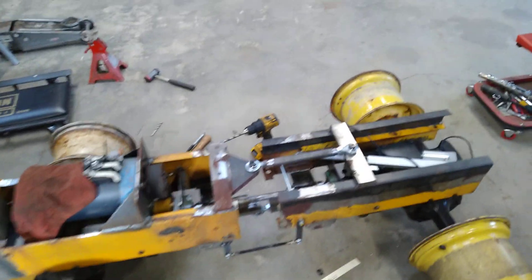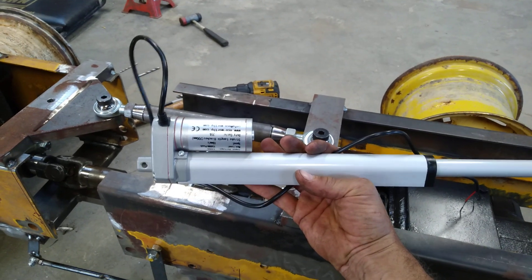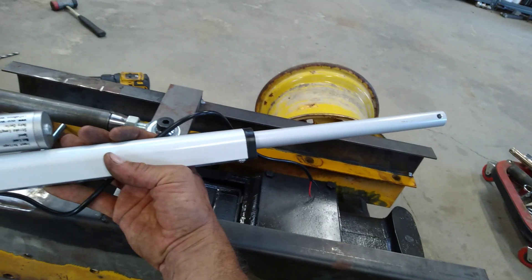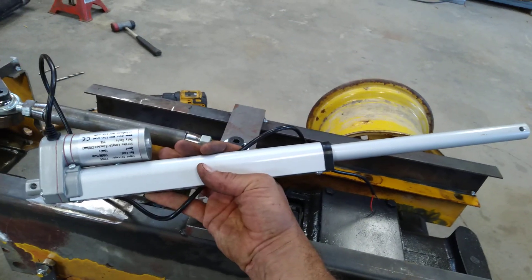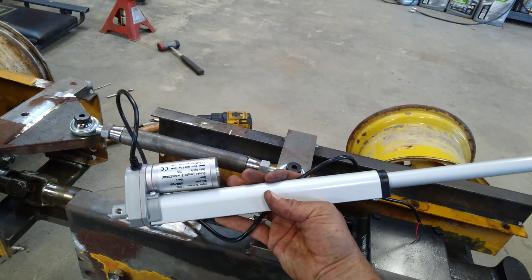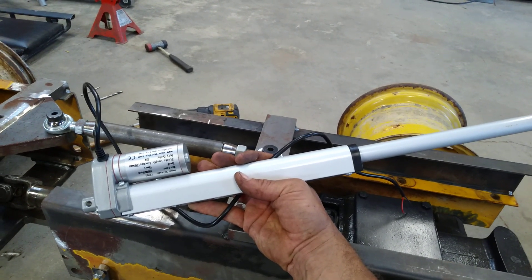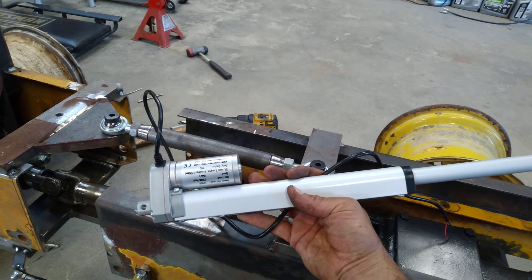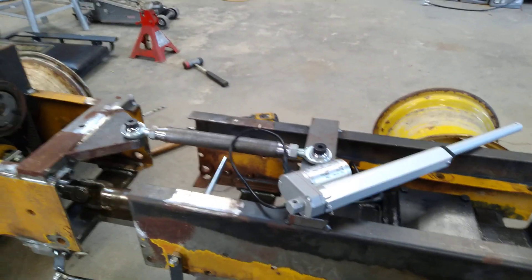What I've come up with is using a linear actuator. Electricity goes in the wire, it turns a little electric motor, it's got some gears and a screw in there. When the gears turn, that screw retracts the shaft piston in, and then you reverse the current and it extends out again. Some of these are fast, some are slow, most are slow. This one has a 300-pound lift capacity and its speed is 10 millimeters per second — less than a half inch per second. But you can compensate for that speed by changing your ratios on the levers it's actuating upon, and that's what I'm playing with right now.